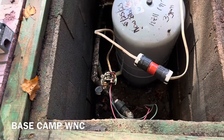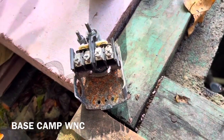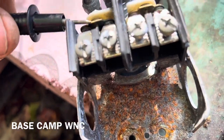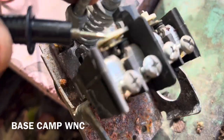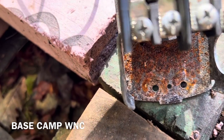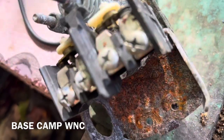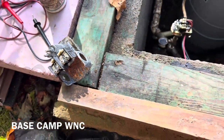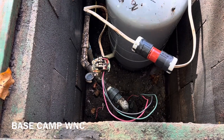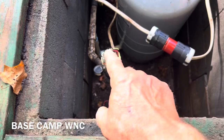The last well and pump was down there for like 20 years. And what actually happened, if I can get it on camera, is the contacts down in here are burnt up. I mean, they got them for thousands of dollars — about five grand to go ahead and pull the well, put a pump in, put a tank in, but didn't replace the $40 pressure switch.